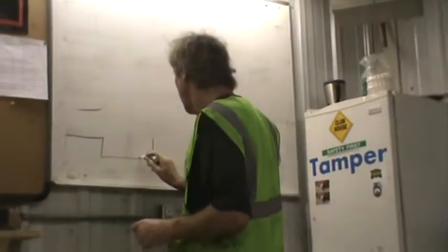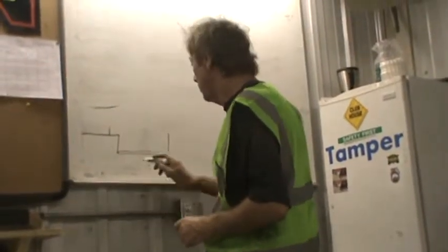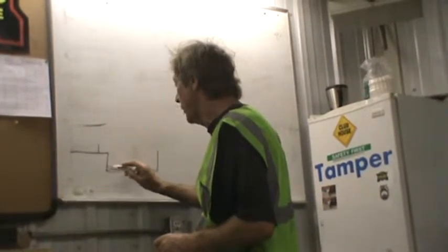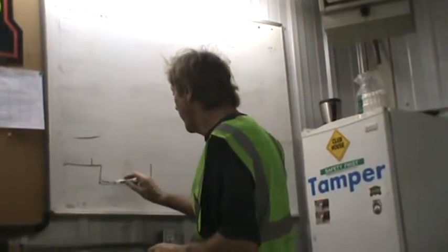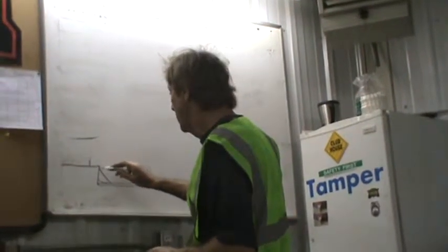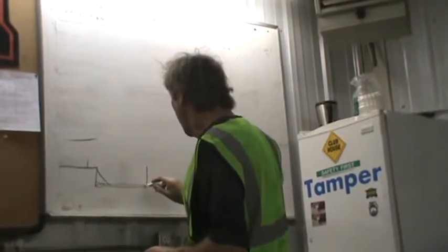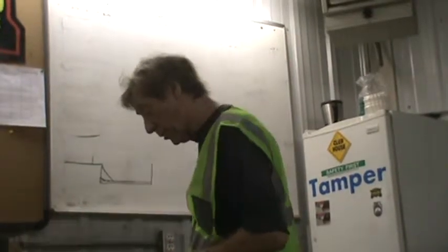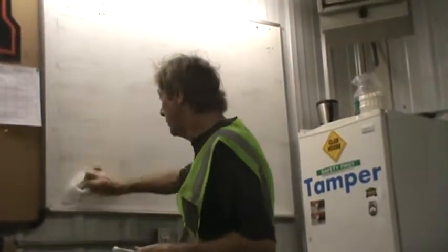This is your boiler, so you want a level bed all over. If you've got a combustion chamber — which these have — it doesn't do any harm to have it slightly higher at the front, to give more heat to the boiler. But don't let it get too high. If it gets too high at the front, you've got big troubles — it won't burn away and then you've got to clean your fire and get it down. So try and keep it level, but if it goes slightly higher at the front, that's not going to be a major problem. It mustn't go right up to the brick arch if you can help it.